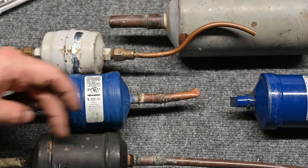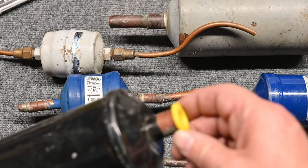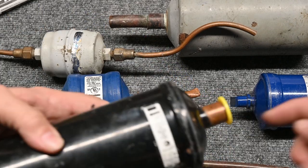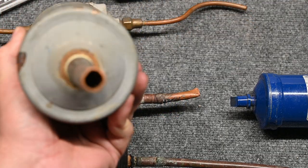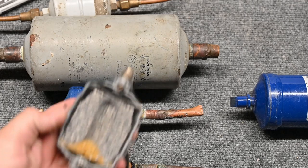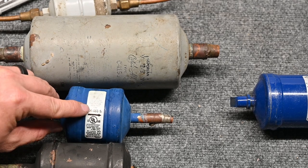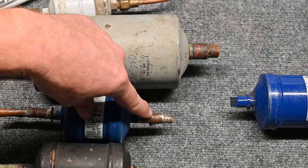Just because you're going to be seeing three-eighths liquid lines in residential doesn't mean that's the only option. Here's a commercial filter dryer — this one's half-inch line. It's a high-quality, high-volume filter dryer. Here's our arrow showing refrigerants coming in. And here's another filter dryer, even larger than that one — a much larger pipe. But it's still a liquid line filter dryer. Some of the differences involve the desiccant size. If we look on here, there's a few numbers we see. The EK being the brand, it has 05 — that's how much desiccant area, I believe in cubic inches. And then the 3 stands for three-eighths. So this is a three-eighths line.